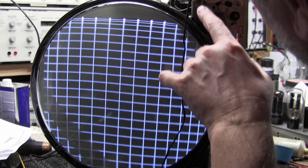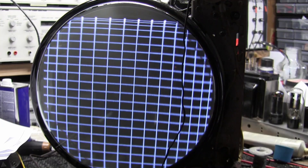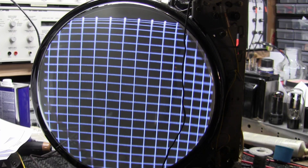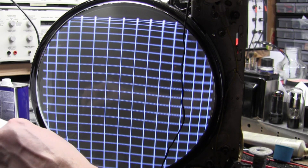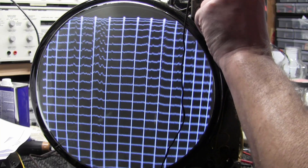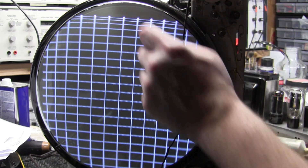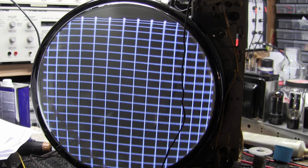There should be a horizontal drive somewhere — that might be on the back — because we're scrunched pretty bad on this side. Now there's a drive control, I don't know where these are though. It's on the front — oh, there it is. It's just a matter of — I haven't recapped the whole horizontal circuit yet, so I'm not going to worry about that.